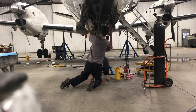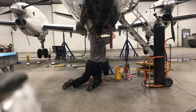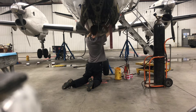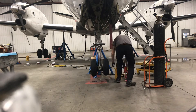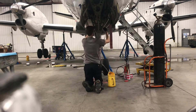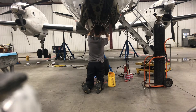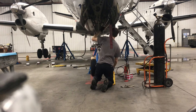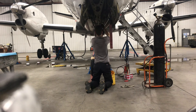So these struts, like most others, are an air-oil strut — the oil being MIL-5606 hydraulic fluid and the air being 100% nitrogen of course. There's a floating piston inside these Saab struts; the air is on the bottom side of the strut and the oil is on top.